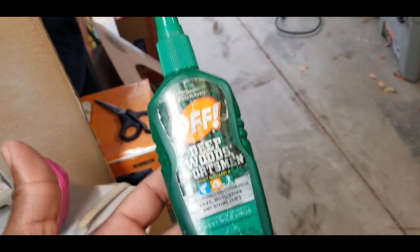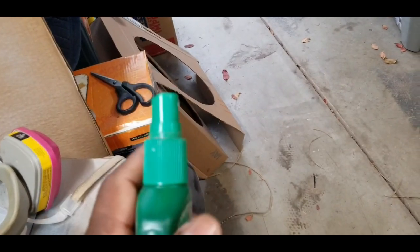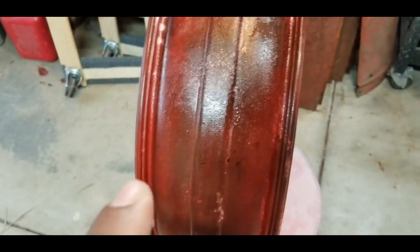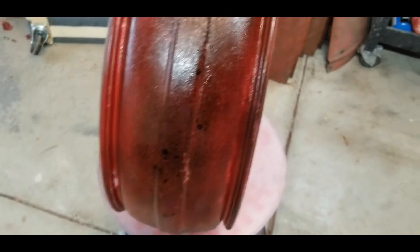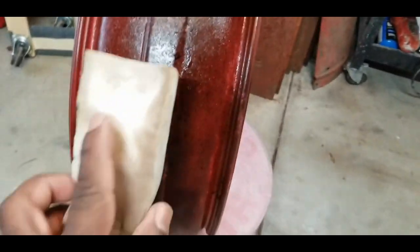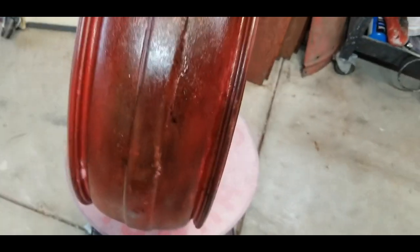Anyways, so I put in here my stain, thinned out with a little bit of lacquer thinner. What's cool about this is it gives me a nice little spray that I can use. I've actually put some on in this area right here, but we'll do a little more around here. Let's see if I can get it within. Okay, that's adding a little color. Got a little magic eraser, any kind of sponge, whatever, and just spread it around a little bit. You don't want it too heavy, and then start creating your color.